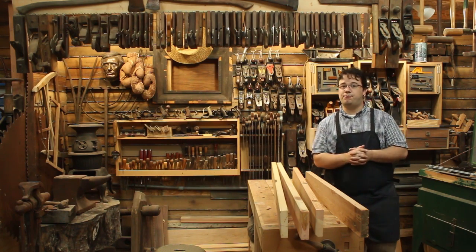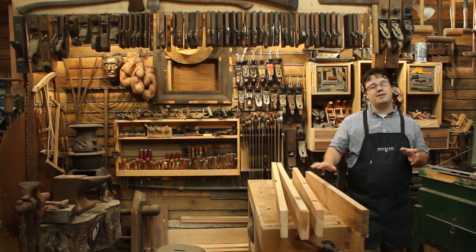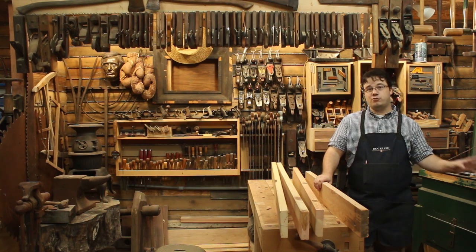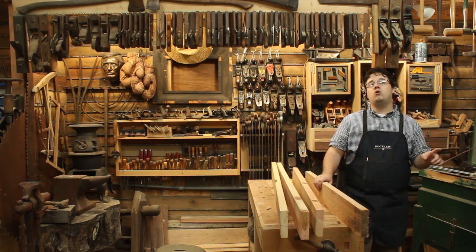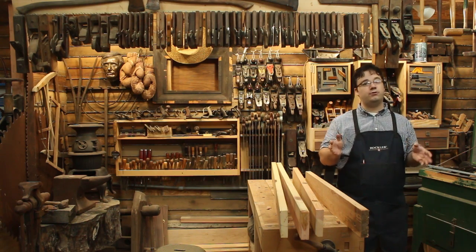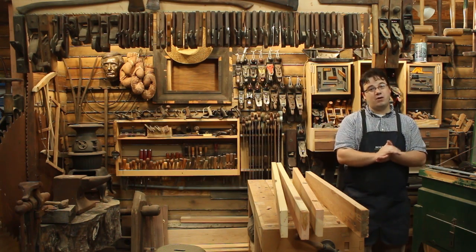But beware, my old-timey friend, the 2x6 is often the knottiest, wettest stock in the box store. So you can either pick through piles of boards and find some good ones, then let them air dry in your shop for a few weeks, or go with 2x10s or 2x12s, which are often much drier and have fewer large knots. You just have to rip them down to width.